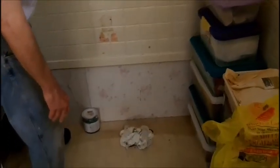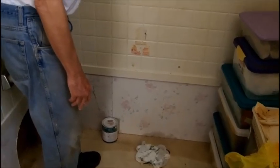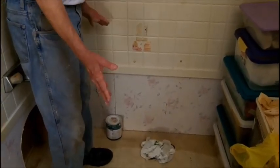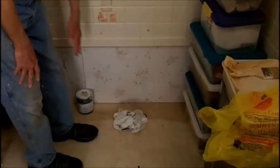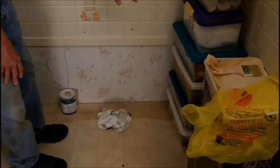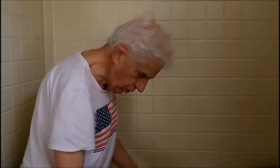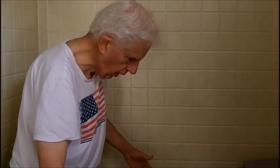If it's 48, the legs can come down here as long as it doesn't hit the plug here that I got. If it does, then I have no choice but to spend big money: 3/4 inch plywood right across, 2x4s right across, and make a bottom shelf that goes right across the whole thing. Slide the totes underneath and get a shorter rack to sit on top of that. The totes are 36 inches deep by 20 inches wide. There's no shelving that I know of that's 36 inches deep unless you get a commercial one, and it'll probably cost me hundreds of dollars.